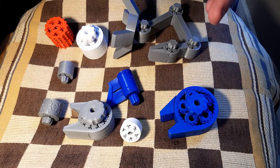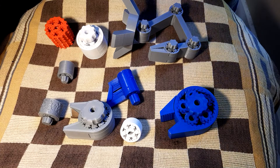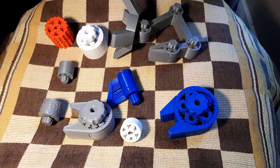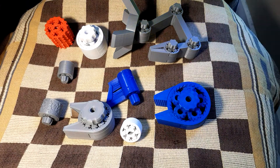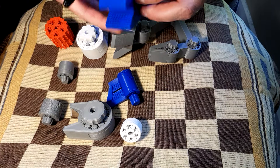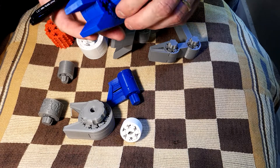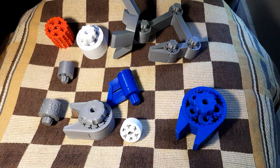The basic formula is to pick a planet tooth count for each stage. For fused sun gears, this implies the ratio of the sun to planets is the same in both stages, which is to say the sun gear is just some fixed multiple of each planet. Next we start with the approximate r equals s plus 2p ring gear and stretch or compress it by whatever is required to make r plus s a multiple of the planet gear count. Throw it all in a spreadsheet and brute force our way to our desired gear ratio. This is not groundbreaking in itself, but combining these techniques gives us greatly more freedom to choose other parameters like gear ratio.